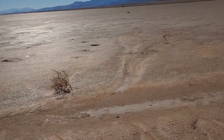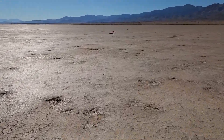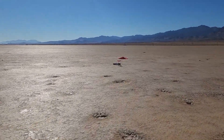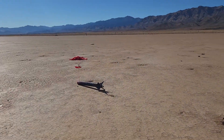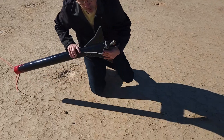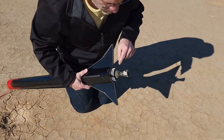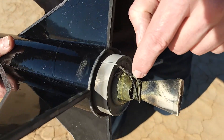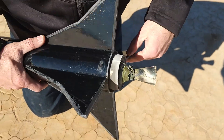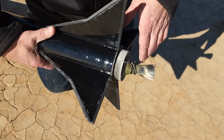We found it — it is quite a distance away from the launch pad. We'll look at the GPS coordinates and figure out exactly how far a little bit later. It looks really good. I don't see any damage. The motor is a little... oh my gosh. We destroyed the nozzle — it blew out the side. That's why the motor is straight but the nozzle is at an angle. So we're going to have to remachine a new nozzle and definitely keep that area thicker right at the orifice opening.